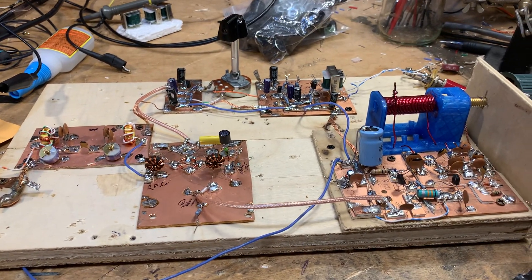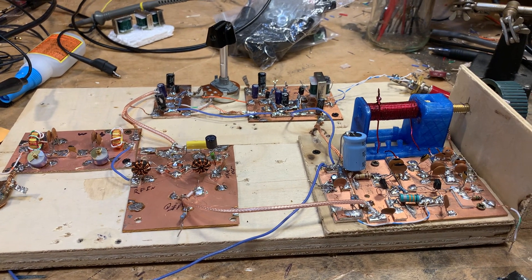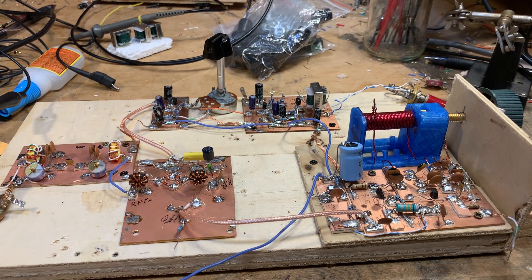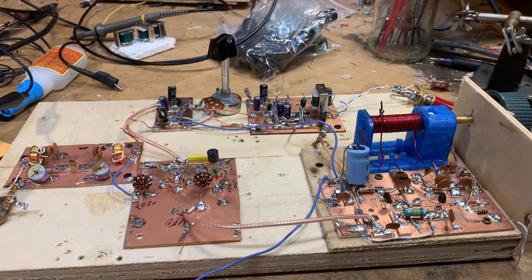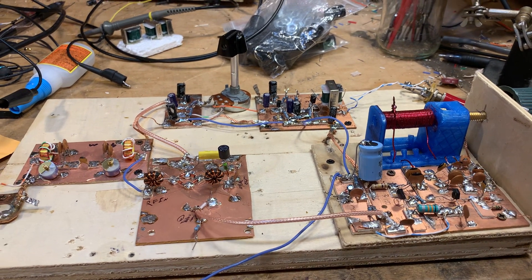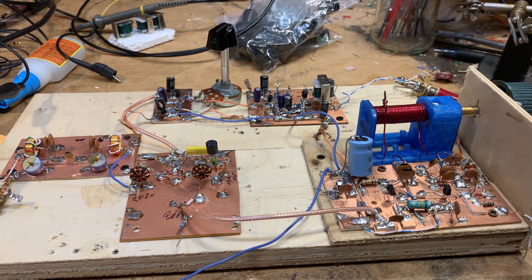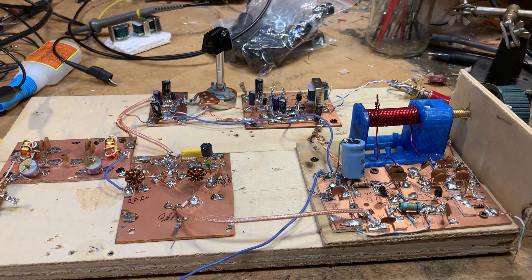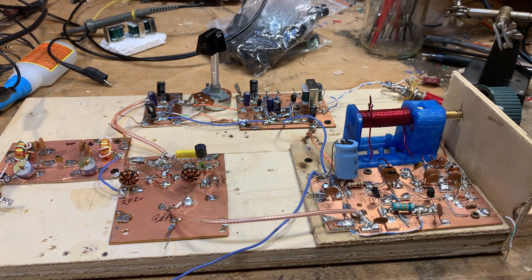The diode ring mixer wins — no doubt about it. Radio Marty is still blasting away at 7335. I've got the diode ring in there now with the W70L diplexer, the low-pass filter, and the 50 ohm through a 0.1 microfarad cap to ground. The VFO input port is putting in 800 millivolts peak — a pretty robust signal — but even with that, I'm getting very little AM breakthrough either from Radio Marty at 7335 or from the powerful FT8 stations.